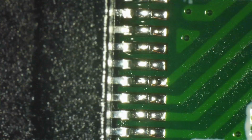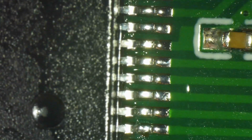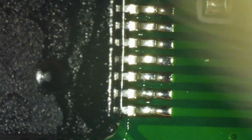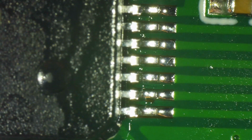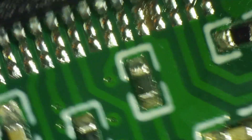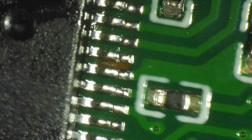So it's important that you do this after the solder job is complete, so you can focus purely on checking if everything's up to standard. This is the time to check for problems. If you miss a short circuit here or an unsoldered pad at this point, this will throw you on a wild goose chase after you turn the computer on, because the last thing you will think about is a problem here. Now you can see there the missing solder mask between pins 4 and 5 from the top.